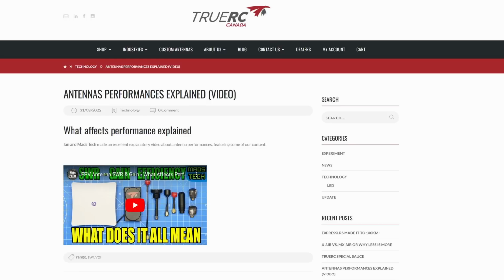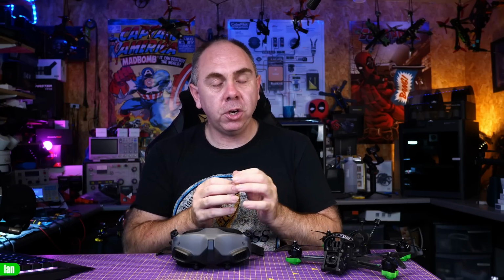There are many, many things to take into account with antennas. It is not just about polarization. And I actually have a video that I put together on antennas that I'll link to in the description, which really does cover this subject very well. It goes into the differences between antenna loss, antenna gain, and it's not just about polarization. You can have one antenna that has really great SWR, but really poor efficiency that won't be as good as an antenna with really high SWR but high efficiency, and there are many, many factors to take into account.